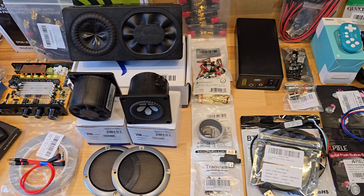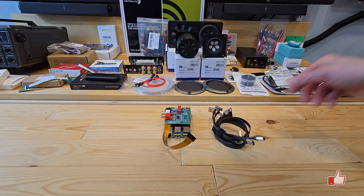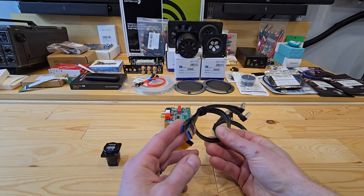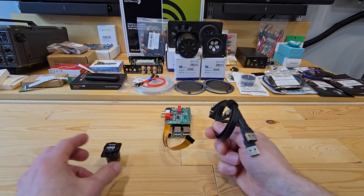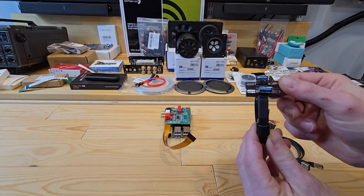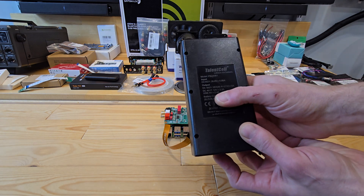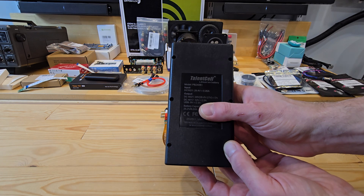Finally, we are looking at the power and peripherals that will amp up this Manic Mod. Like the microSD, HDMI, and speakers, the USB will be extended to the side of my Raspberry Pi Jambox. I've ensured these are right angles to avoid clearance issues connecting to the Pi. These male-to-males can be used with a socket for an easy exit to the exterior, but I've also procured male-to-females for additional or alternate ports. I'm using this Talent Cell 24V lithium-ion battery, and its only shortcoming is that the 5V output only provides 2.4A, while the Pi should have 5A.